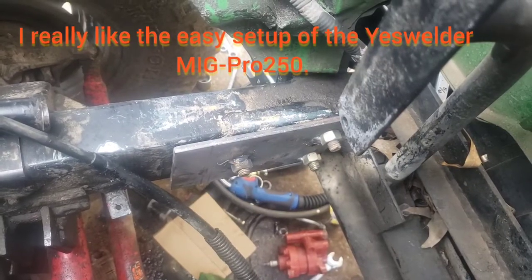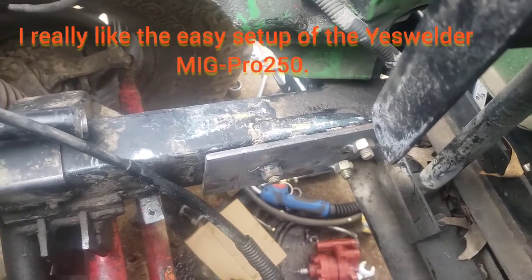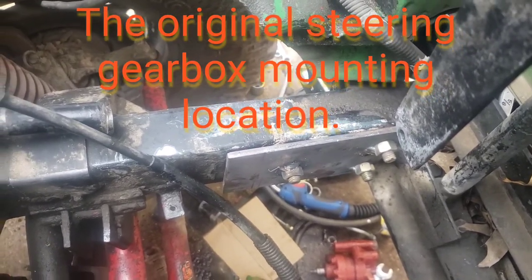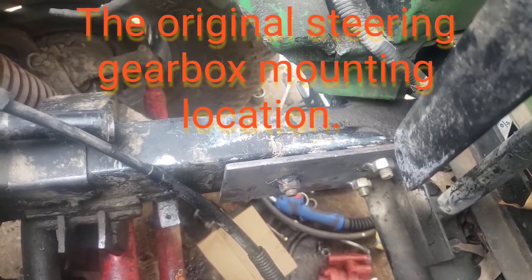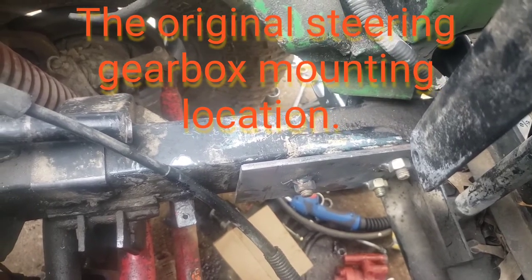Like I said, we've got a couple good heavy tacks there. That's really all we need to hold those nuts on — we don't want them spinning. I was in a tough spot there to try to get those. So next, let that cool off, pull that off, and then weld the orbital valve bracket on.